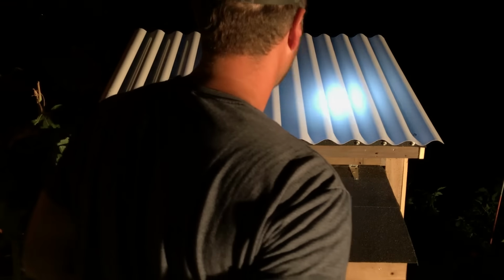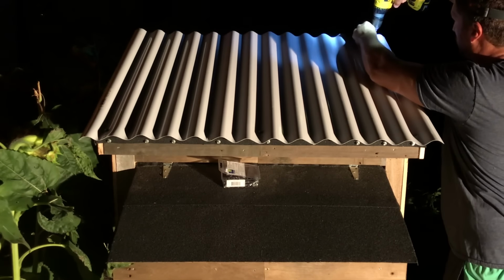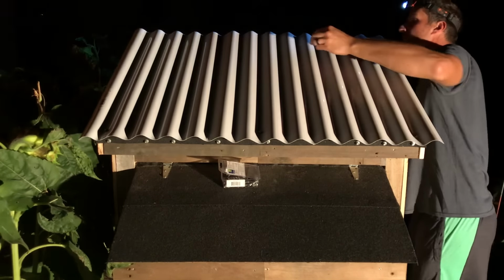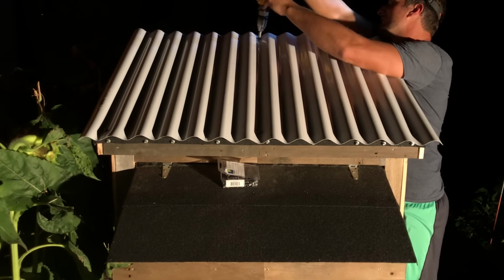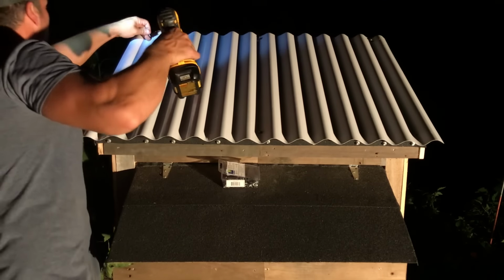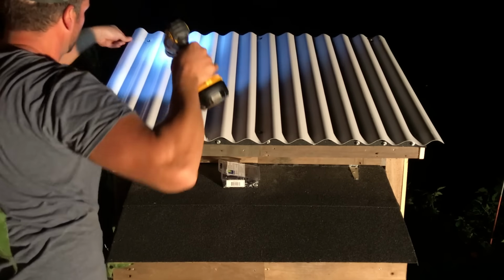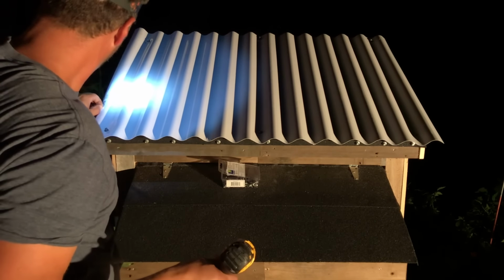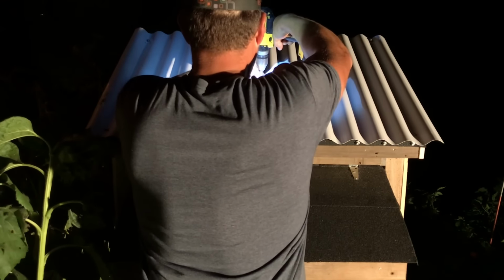I mentioned this in my other video also, but the stuff that's on top of the nesting box, I believe it's called, what's it called? Water and ice barrier. I think that's what it's called. I'll put a link in the description to what I'm talking about here. But it's about 25 bucks a roll maybe for probably 50 feet of it. It's really intended for, if you're building a deck, you would put it over the ledger board, which is the piece that you connect to the house. But anyway, it prevents water from getting down in between the ledger and the house.